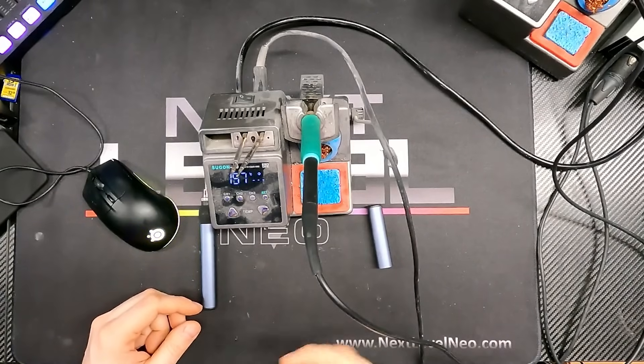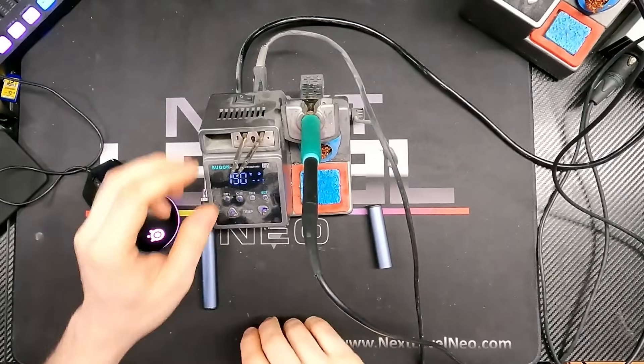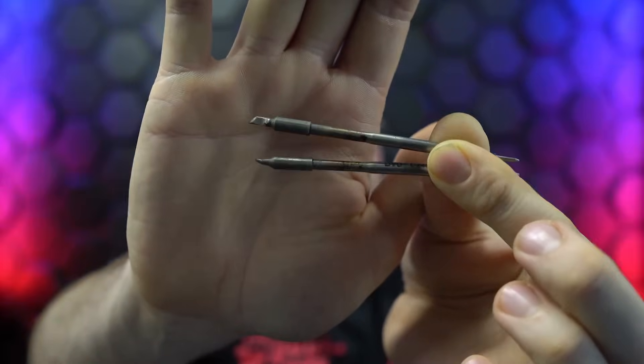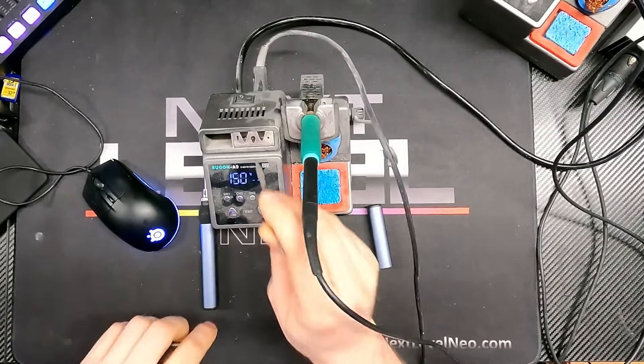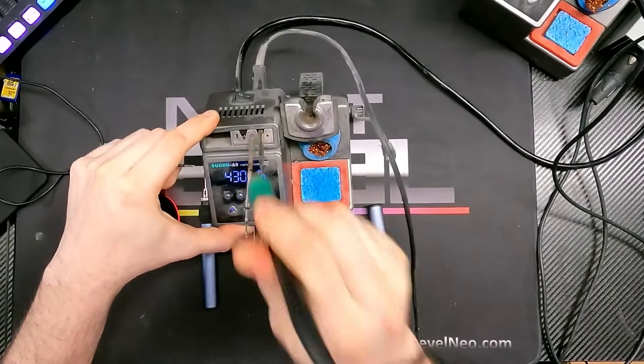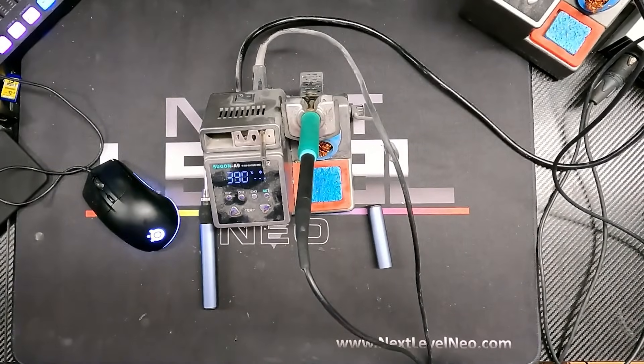One of the big things I really like about this iron is the quick-change tips. Normally you just make whatever tip you're using work because it's a pain to let it cool down and change the tip just to solder one little thing. But that's not the case here. I have two extra tips — one is a fat tip and one is an angled pointy tip — so I have the straight, angled, and fat tip, all included with our kits. All I have to do is put the fat tip in place, shove the iron in that hole, pull the tip out, put the new tip in, and that's it. I didn't have to touch anything. That tip was at about 400 degrees Celsius, so if I had touched it, it would have left a permanent mark. And that's the beauty of it.